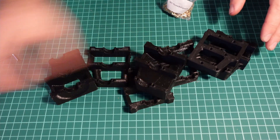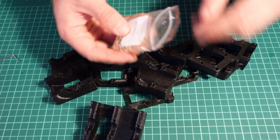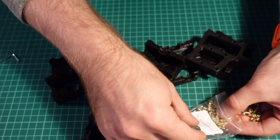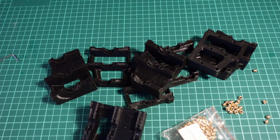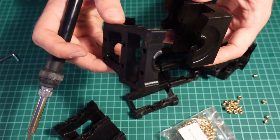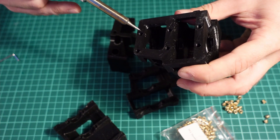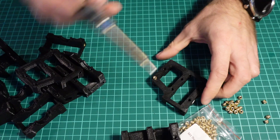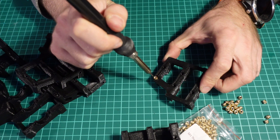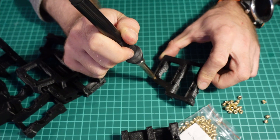Now let's prepare the plastic frames. To do so you will need a lot of M3 threaded inserts and a soldering iron to install them. I use my standard soldering iron from a soldering station set to around 250–260 degrees, just not to overheat the ABS. There are two parts of the frame — one smaller, one bigger. You will need to install six threaded inserts into the smaller frame and then add three more on top of the assembly. The main rule of threaded inserts is: don't rush and don't push them too hard — just wait until they start sinking into the plastic.